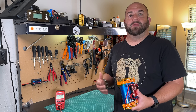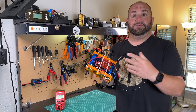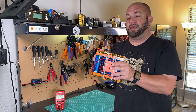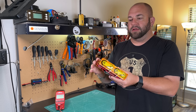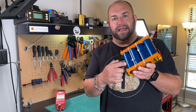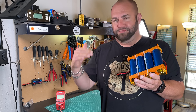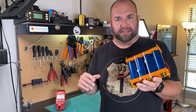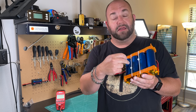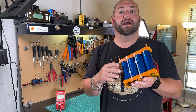Generally, with most commercial lithium-iron phosphate batteries you're going to buy, they're all going to have a BMS or battery management system inside — like this board right here — that's going to balance each individual cell to make sure they're all at the same voltage. Each cell in a lithium-iron phosphate battery has a nominal voltage of 3.2 volts, and they actually charge to 3.65 volts per cell.